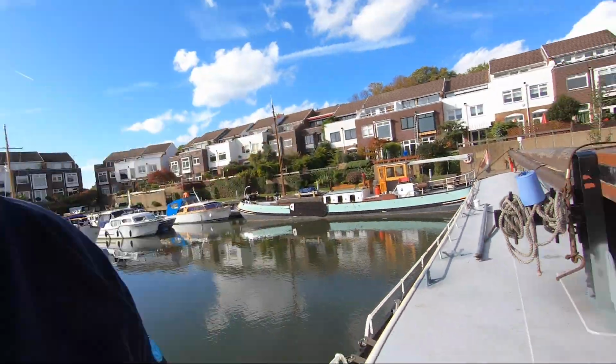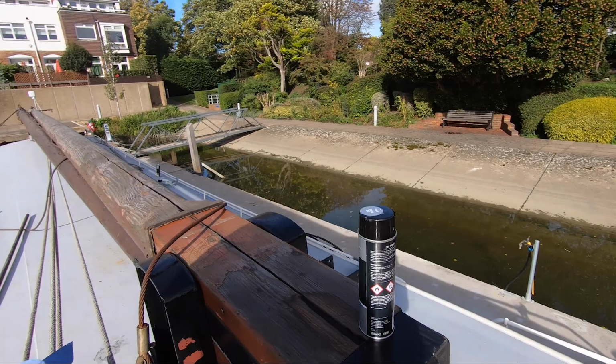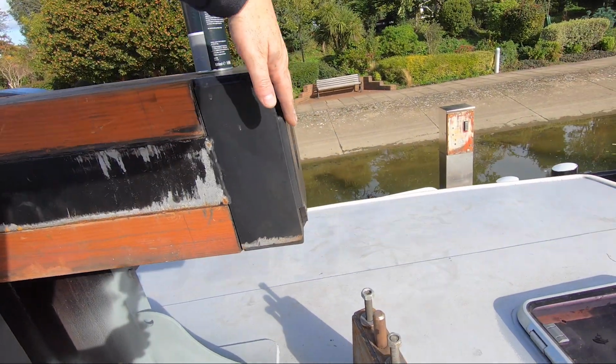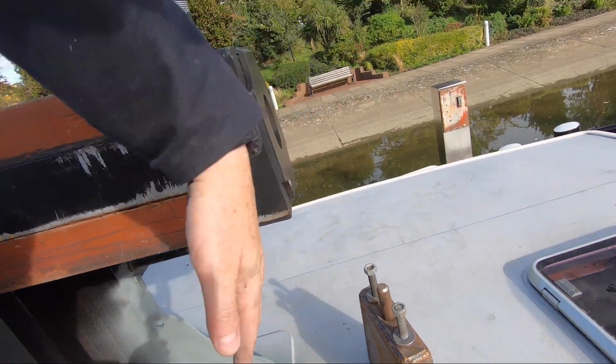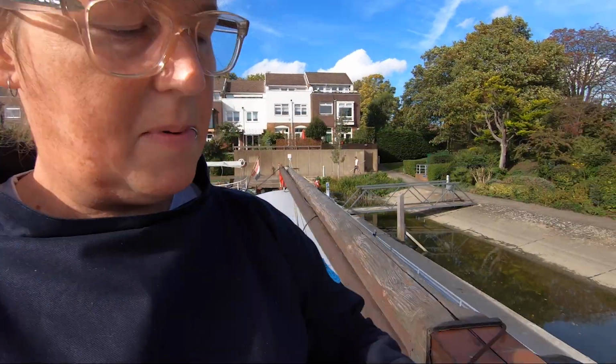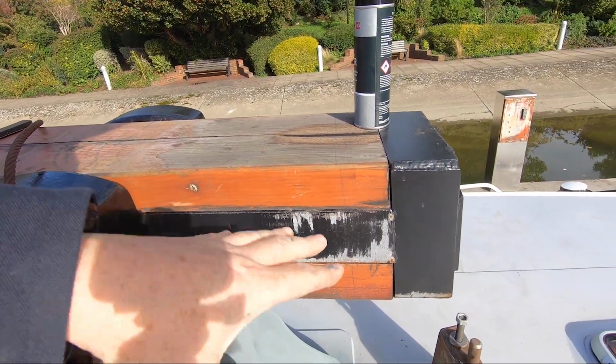And then up here is this wedge that comes out. Now the mast is really clever, because you might notice that it's chamfered this way, so when it drops in it has an open angle. There could have been a couple of ways we could have done that. We could have had a closed angle, so when it came in it pushed up on a block and lifted itself up. The idea is that it doesn't sit on this pin, but actually sits on the bottom, where all the support for the mast is. So we could have done that, but then it would have been a little hard to pull the mast up the last bit. It would have had to go uphill a little bit.